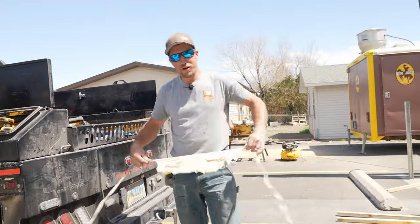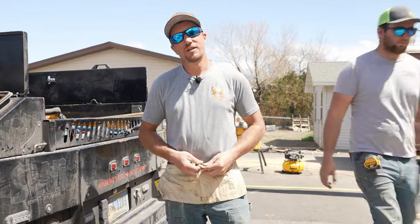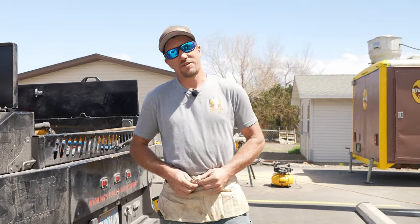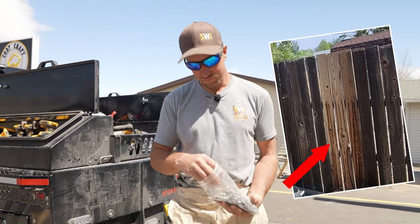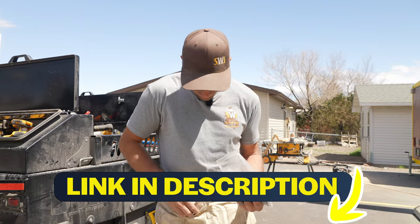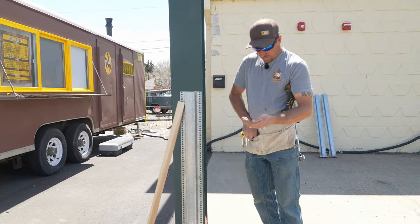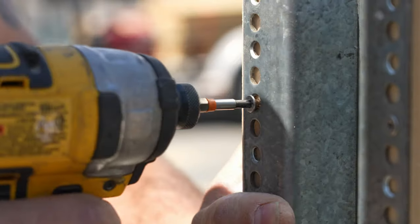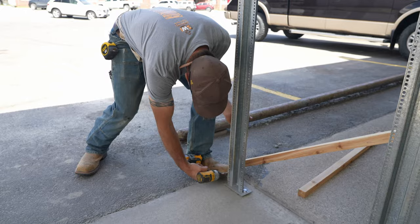Now, I'm sure you're asking yourself, is there a special kind of hardware that you should be using when dealing with cedar fence? You should be using stainless steel fasteners. If you don't want black streaks, use some stainless steel screws. Make sure and see the link below. So we're gonna be looking to put 3 to 4 stainless steel screws in per nailer.